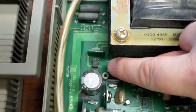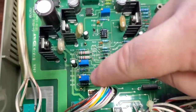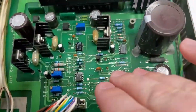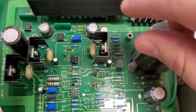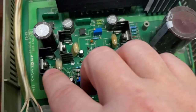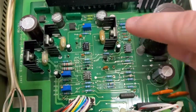This one here is the miniature rectifier for your display power supply — it comes in off these taps, goes through here, and then comes down here which is your display interface cable. Then in the middle of the board, this is going to be your reference and bias: you have that little bridge rectifier right here, then it comes down and you have a plus 12 volts and minus 12 volts — which is really interesting — and then you have a 5-volt voltage regulator right over here. So you've got 5 volts, negative 12 volts, positive 12 volts, and all of your miniature pots for adjusting those.